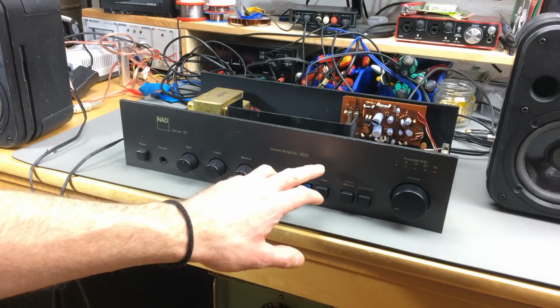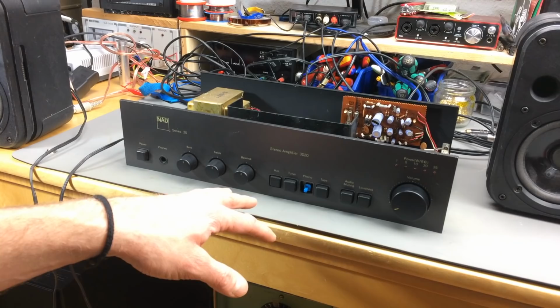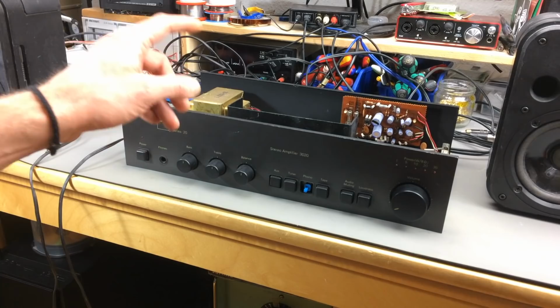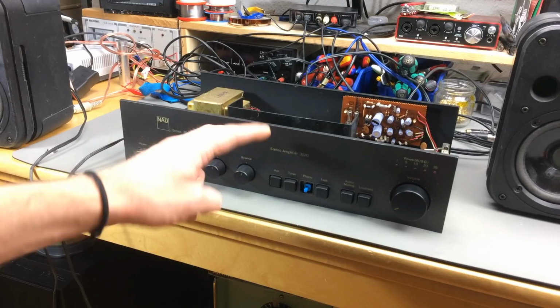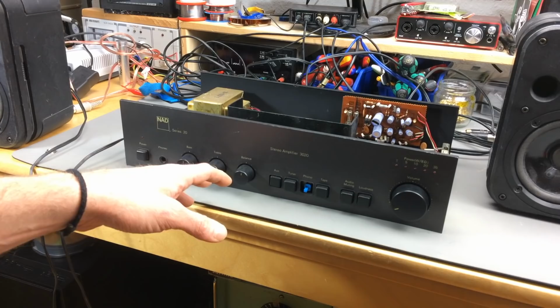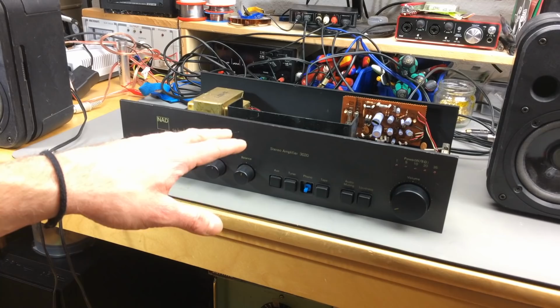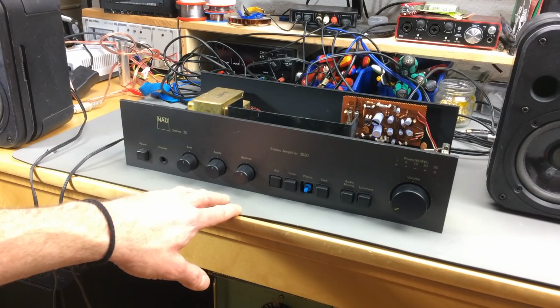Like I thought, they seem to have a delay before they are switching on the speaker outputs. And usually on the A and B models, it's two capacitors that commonly fail that are responsible for the delay. If those fail, the speaker outputs are switched on right away and give out the power on noises, which we heard. So I still suspect this is an issue with the capacitors that are responsible for this delay circuitry.